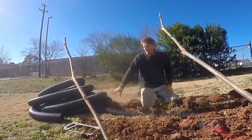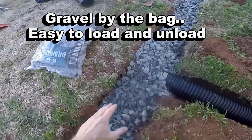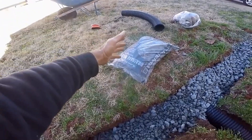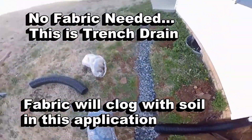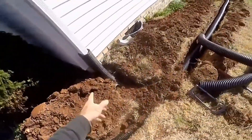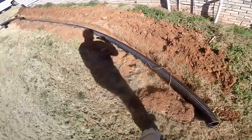Just go underneath your cable wires and let it come out on the ground — at least on this application, because we've got tons of holes down here. We'll gravel by the bag, and you can see how it's going to turn out. We're going to leave this gravel exposed — bring the gravel to grade — because we want that water to come down the hill and drop directly into our system. It'll hit the bottom of the trench, flood up through the gravel, into the holes on the bottom of the pipe, and be carried away. The catch basins pick up the immediate surface water runoff. Over here we switch to solid pipe and pick up another downspout. The pipe comes out and discharges — we'll cut it off at an angle right here at the end of the trench. Now we're ready to backfill and we're done.